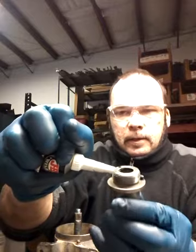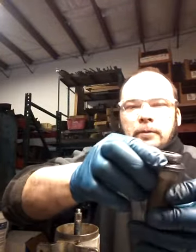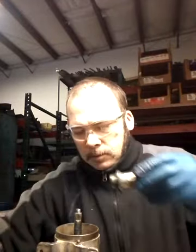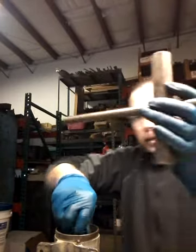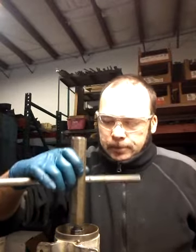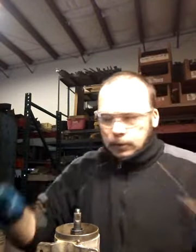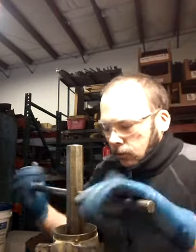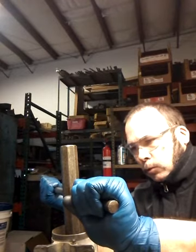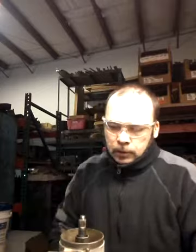So anyway, this is your gland. Gonna receive a nice helping of RTV, and that's a silicone sealant. Alright, goes down right on there and screws into the body of the door closer. Got a G3 wrench. I'm going to use the clean side. Hopefully, G2 wrench. Should listen to my own. It's the G4 wrench. And there she is. We're just going to do it kind of tight. None of this stuff gets real huge amounts of torque, because we don't want to fracture the body of our door closer. It's 100 years old, so we're gonna show it a little bit of respect.